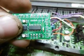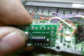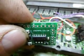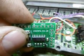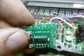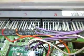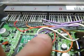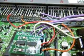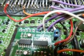This is the end that you can see there in the bottom right, and it says power and I/O on the printed circuit board. So the next connections, the 6 main connections, are made to the top row there that you can see on this little printed circuit board. It says MCM, and that's the 3 wires that I mentioned earlier on: command power, MAM mode 1 and MAM mode 2. Now they are accessible in different places. We've got the purple wire here, you can see, and that's command power. Then we have the grey wire, that's MAM mode 1.